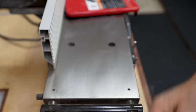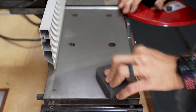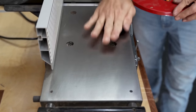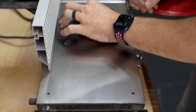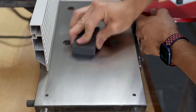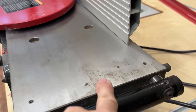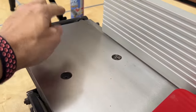Got the coarse done, going back with medium, and then the fine last — that's made for the polishing. Just putting light pressure and moving it with the direction of the metal grain. If you go across it, you'll see it'll actually leave a little streak. Look at the difference in the sides — the one I have clean on the left versus the one that's not clean on the right. It's going to make a big difference when you start sliding stock on there. That stuff is starting to rust and a little sticky, but you get over to the clean side and it's pretty slick.